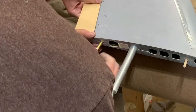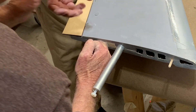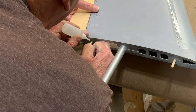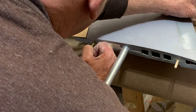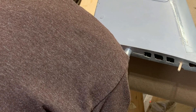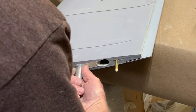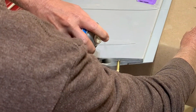Got it. Fingers getting tired. So theoretically, I've got the epoxy on the back, we've got our tube in which centers the dowel — otherwise the dowel could be off just a fraction of an inch, which would make a tight fit. So we're just going to put a bit of CA on there and hit that with kicker. There we go — this is just like spot welding, but it's a temporary hold. It's cured, so now we'll just put a little CA on the backside.